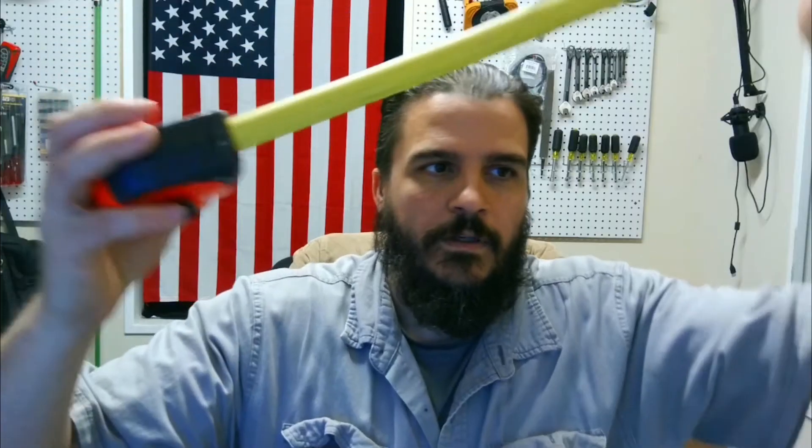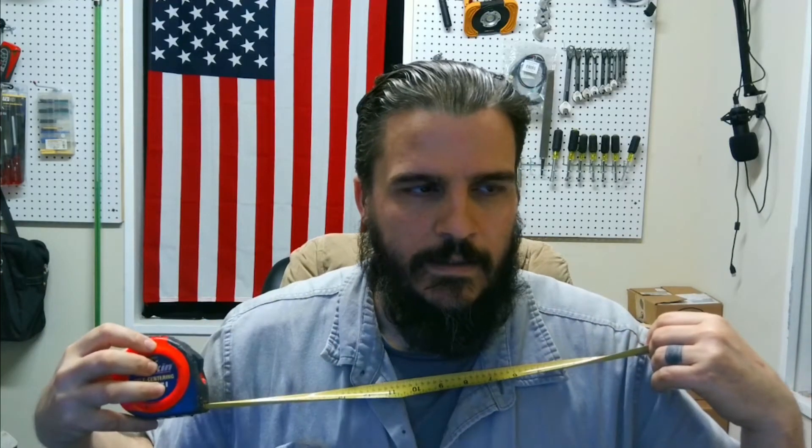When you're using a tape measure, there are two ends that matter: where you're starting from and where you're ending. You're not just measuring in the middle of nothing. You start at a point — say I wanted to measure the width of my shoulders — and you end at a point to get your measurement. The reason this is so important is that there's always a starting and an end point. We refer to the starting point as a 'reference' — whether you're talking about pressure, distance, or voltage. You are measuring the difference between two points, sometimes referred to as the delta.